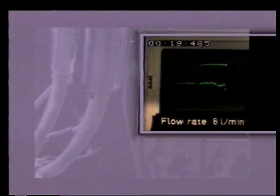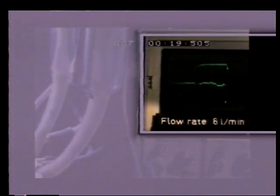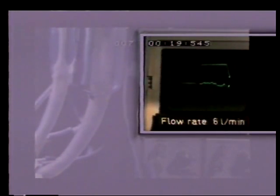The horizontal line, which is the vacuum level under the teat, stays stable during the milking phase. During the closing of the liner, a dip is observed in the downward position when the milk is pressed down to the claw. This complete pulsation cycle has in real time taken only 1 second.